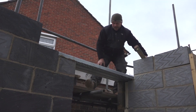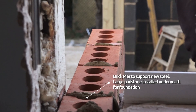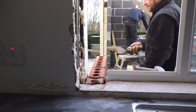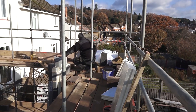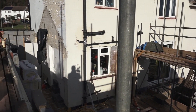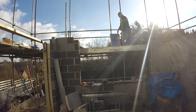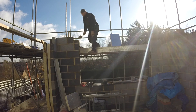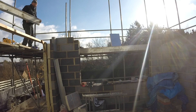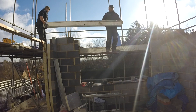These are really good because they cut down cold bridging by a huge amount — they've got insulation inside and they've got GRP. Now this is a brick pier, which is actually going to be for the new lintel. It's more than a brick pier — it's a stretch bit of wall because we've taken it up to the door frame. There's no point doing a little brick pier and then one thermolite block, so because we've got good insulation in this house we thought we're all right with that.